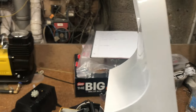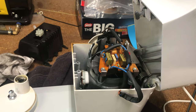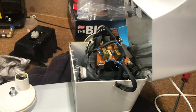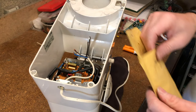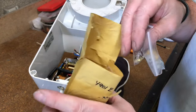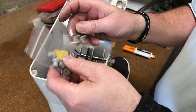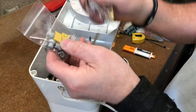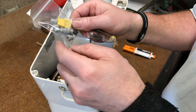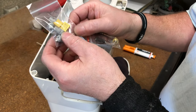A cup of tea and I think we'll have this back up and running — the magic of video, I'll come back in two minutes with the capacitors. Oh, here we go, direct from eBay. There are quite a few suppliers that still sell kits for these Kenwood mixers. I've opted for a kit that's got five feet, a triac — not a transistor as I said earlier — two of the X2 capacitors for noise suppression, and there's a resistor in there.